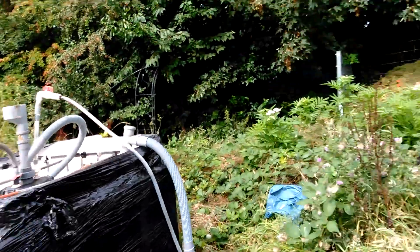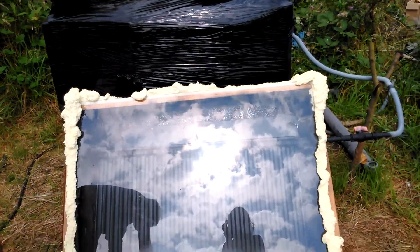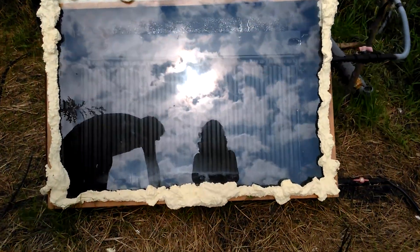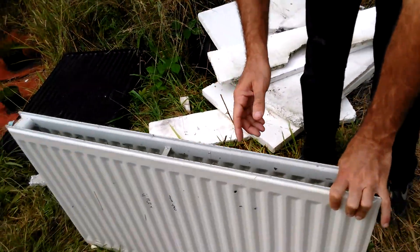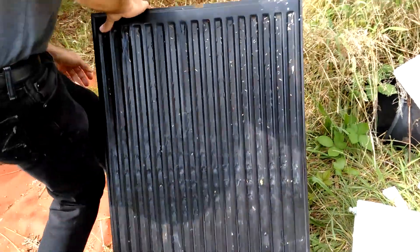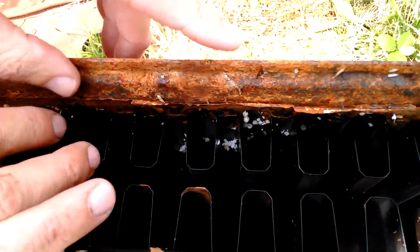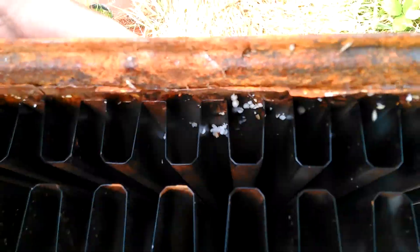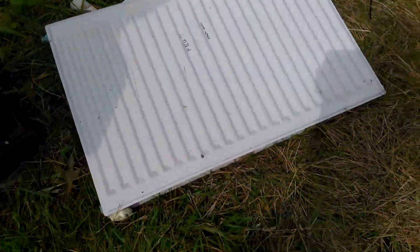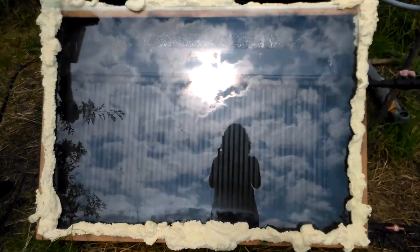The other experiment involves an old radiator. We started out using double radiators, thinking we'd heat more water, and we painted them black. But the problem was that after seven years of operation, corrosion caused a leak that was impossible to fix because it's somewhere inside. From now on we don't recommend double radiators — a single radiator is better because if it springs a leak you can find it on the front or back side and fix it with epoxy.